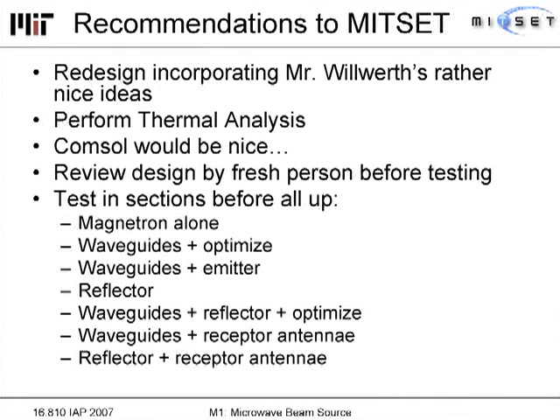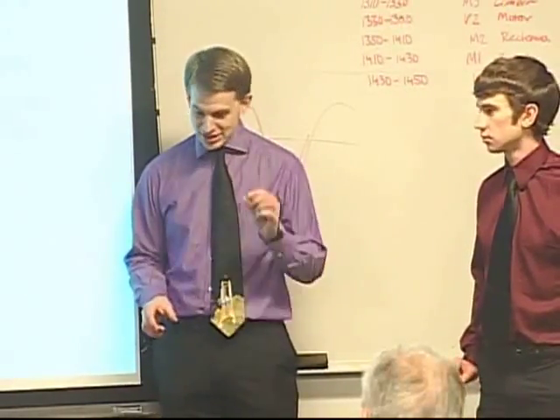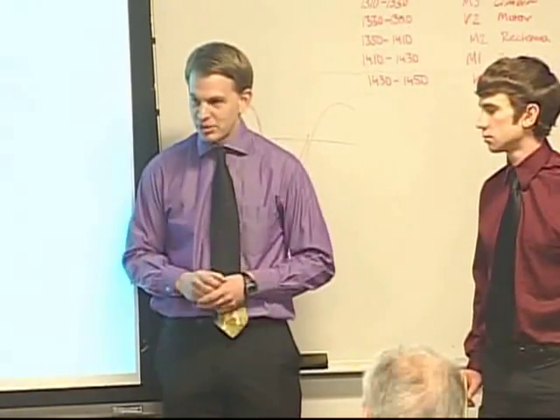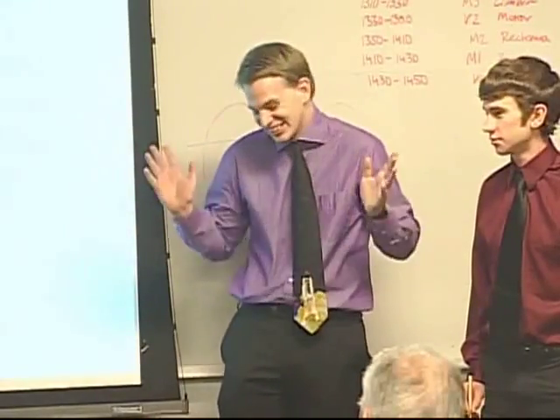A few recommendations going forward: we received a lecture on Tuesday that requires us to change several things. We haven't done a thermal analysis, which could be a significant issue — it requires a full 3D model in COMSOL, which we don't yet have. COMSOL itself costs $2,000, which is a barrier. Also, literature makes very clear that what you design will not be what you get in practice. People who build microwave circuitry take a steel ball, roll it through the circuit attached to a magnet, and wherever they observe anomalies they drill holes and add screws to tune it — this is apparently just how it's done.